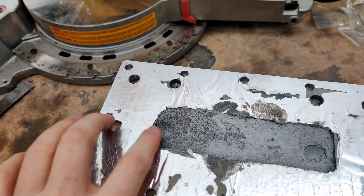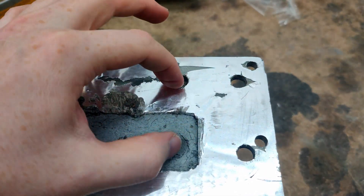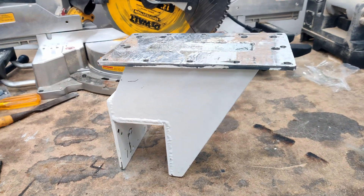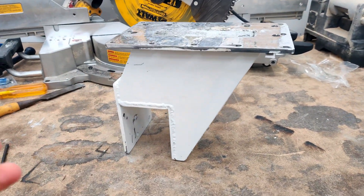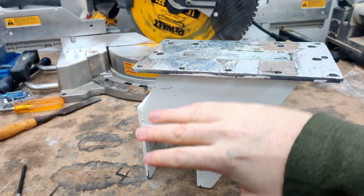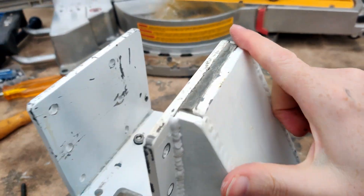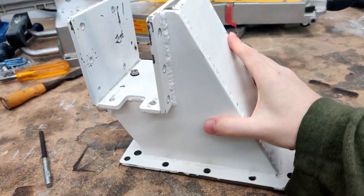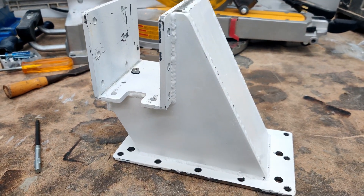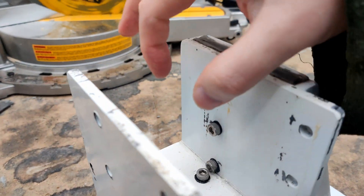After the second day I pushed my finger in here and here so I could complete the locations where the screws are going to go for the bearing carriages. While I was researching how to mix this stuff, some places suggested that you mix it and let it sit for five minutes and it'll kind of harden slightly and become more like peanut butter in viscosity. In my case I don't want to do that because I want it to free-flow all the way down to the bottom. So once I mixed it and had as much grout into the water as I could while it's still liquid, I just poured it right away and that seemed to work pretty well.